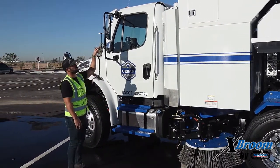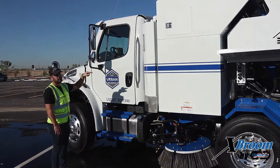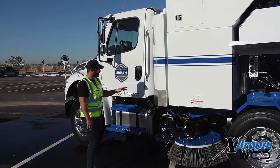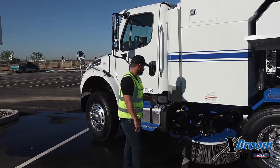There is a filter on the top of the tank. When you swap out your hydraulic fluid every thousand hours, you're going to want to make sure that you do that filter as well. Inspect that, make sure all the bolts are tight, make sure you don't see any cracks, and make sure it's nice and clean.